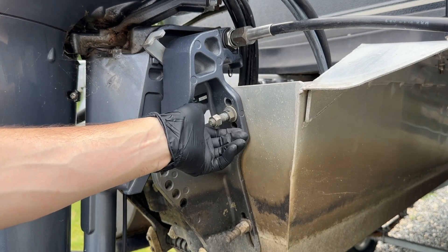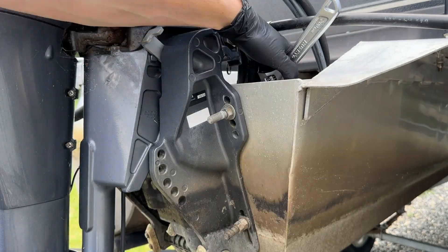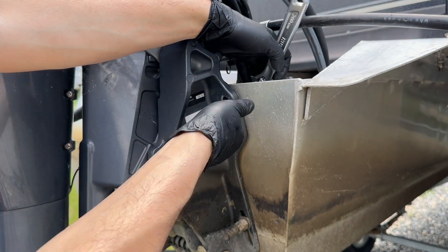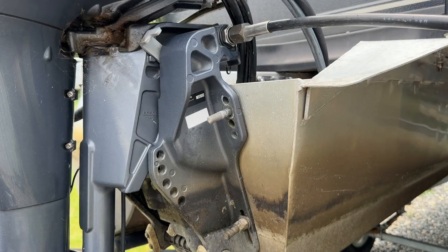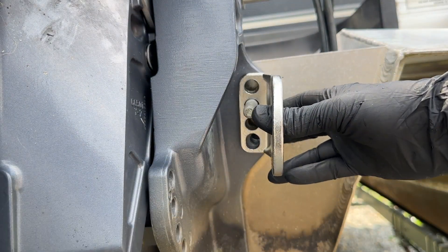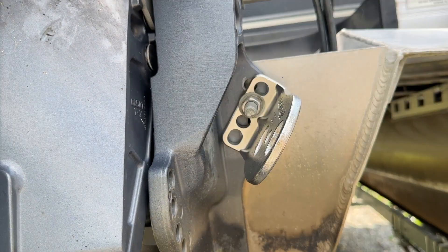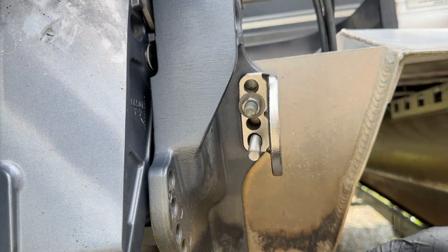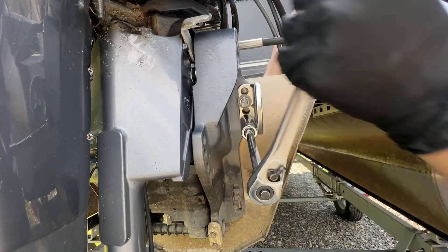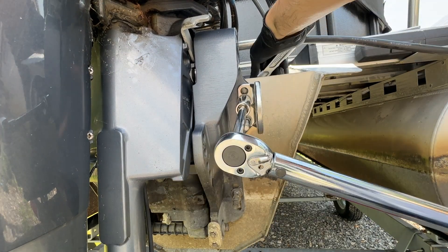Now I'm going to use a 17mm deep socket to remove the existing Yamaha mounting bolt. As I mentioned before, the motor mount lifts off the transom a little bit when taking this off — I would recommend completing one side before moving to the other side. Removing both top bolts at the same time would be asking for trouble. The Turboswing brackets are marked with an L and R to indicate left and right sides. I'm working on the right side now so I'll use the bracket with the R on it. My motor mount uses two nuts to lock each bolt into place and I'll put those back on the same way I took them off. The new Turboswing bolts use nylon lock nuts. I used a 19mm deep socket for the new nuts and snugged everything up with my ratchet before moving onto my torque wrench.